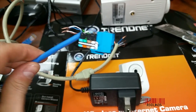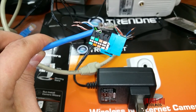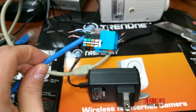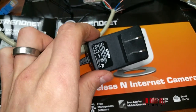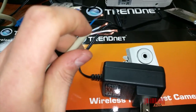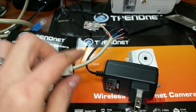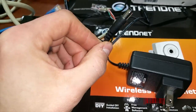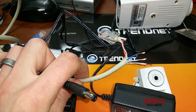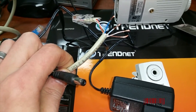I'm using a separate female-to-female connection so that I can use this Power over Ethernet solution with any Ethernet cable, not just the one provided in the box. What we're going to do is take the five-volt power supply that came with the camera and splice it into the wires running on these pins that don't carry any data. Those pins run down the cord, and on the other side we'll splice into your power plug and pop it into the camera right out of the Ethernet — brilliant and super simple, because the pins aren't being used for data transfer at all.